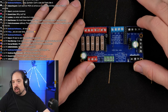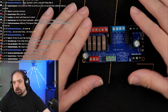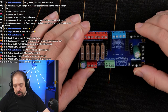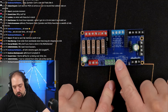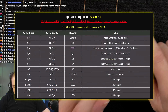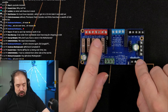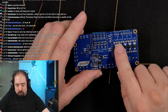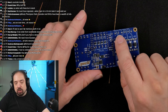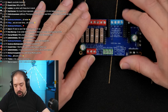This is a DIG Quad. It's a four channel — and secretly five channel in this revision, which we've been using for about a year. You have four LED channels here and a Q1R port, which is secretly your fifth LED channel. The main thing is it can handle at least 30 amps continuous using its input terminals, and has five fuses and seven output terminals. Some of the terminals are shared — one and two are shared, and three and four are shared — so you can use edge or middle connections for power injection.